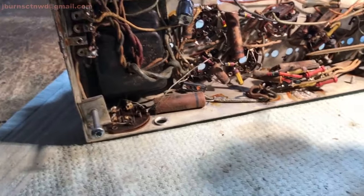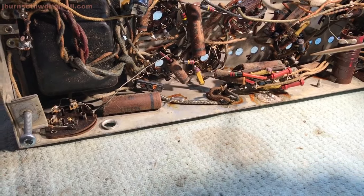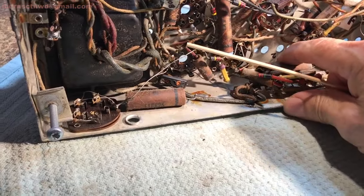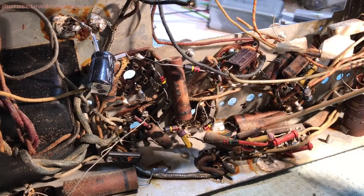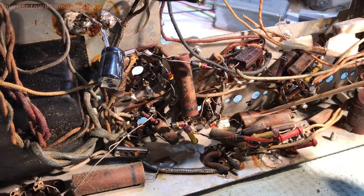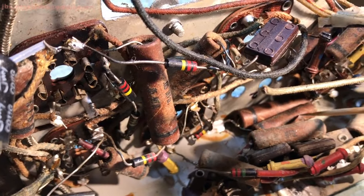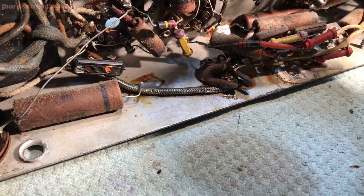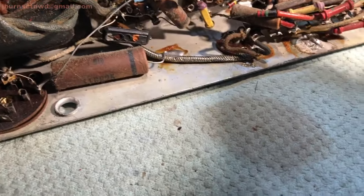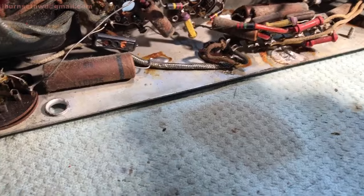I mean, if you looked at the schematic, you wouldn't have any idea where in hell that one went to. And I almost missed it on the last chassis that I did of this. Besides that, there's another one hidden way down in there, on back behind this thing, or up top of it, or snuggled back in there, nice and neat. And there is a second one right down in there that almost parallels it, but it goes to a different lug of the B7 tube. I think that's the B7 tube. It's a tube socket, that I know.